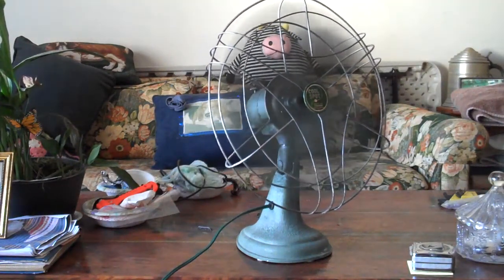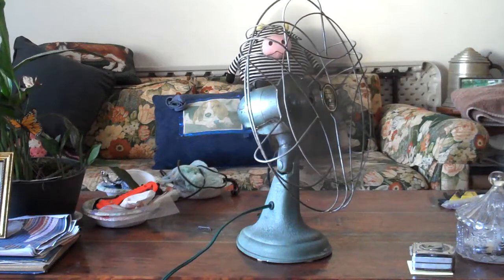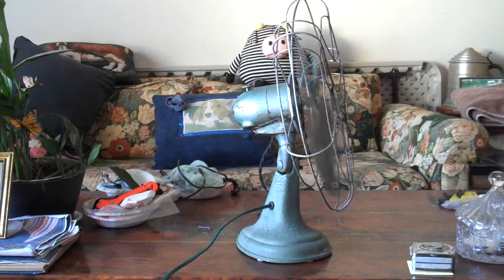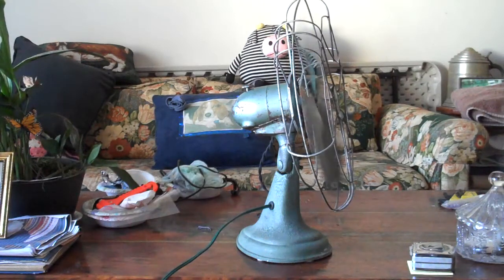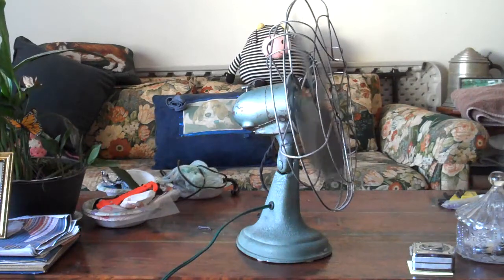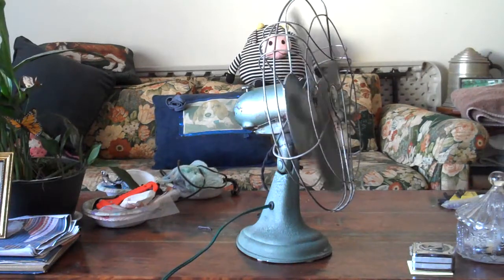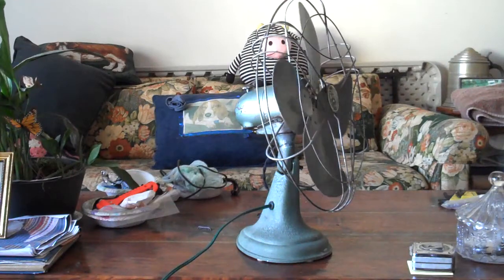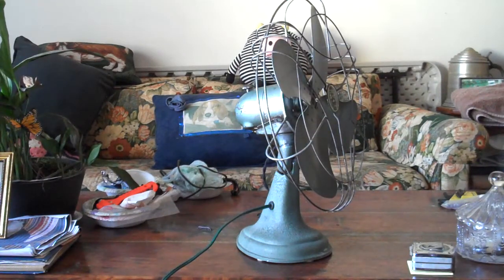The spin down time on this thing is really long. What I did was I cleaned out the bearings. I completely disassembled them from the bearing carriers and cleaned them out with a little bit of heat and re-soaked them in oil so that they got a new bunch of oiling in them, and they work really well as a result of that.